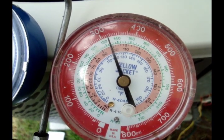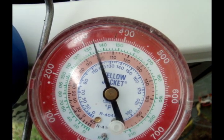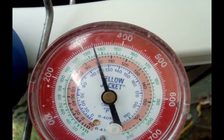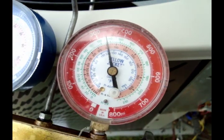It's 95 degrees outside — this thing should just scream up to 400. Instead it just flutters and flutters. Pretty much doesn't go much farther than 325. It's a reused compressor by the way.